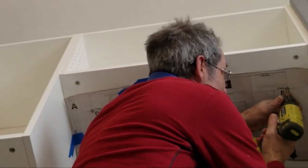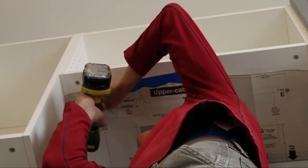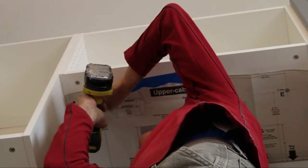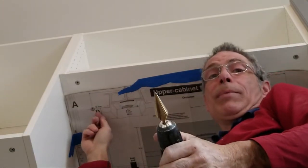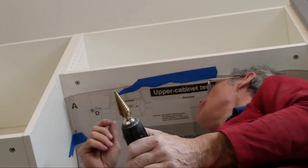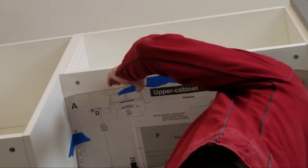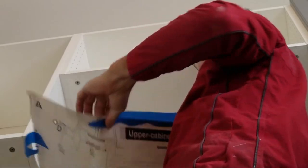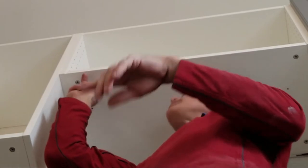And the same here — just bring it down a little bit — and then this one here. Now these holes here are going to bolt your microwave right to the cabinet above. They also tell you what size hole to drill, so now that I've marked my holes I'm going to drill them. It's a half-inch diameter for the bolt hole.